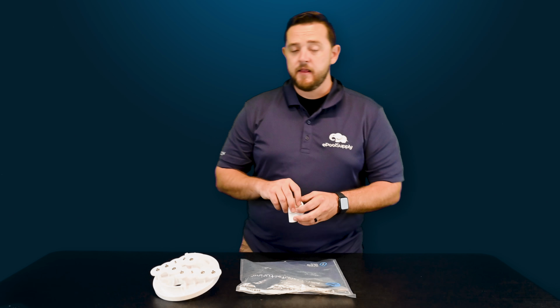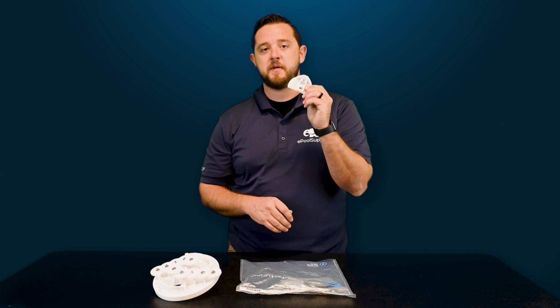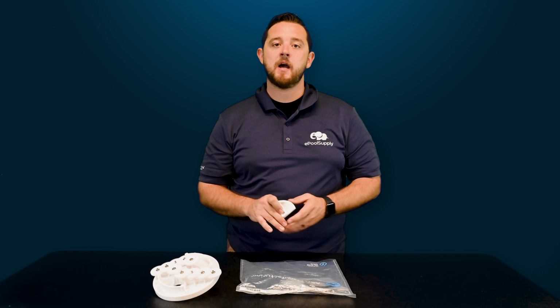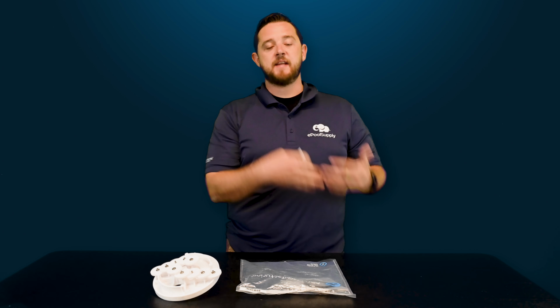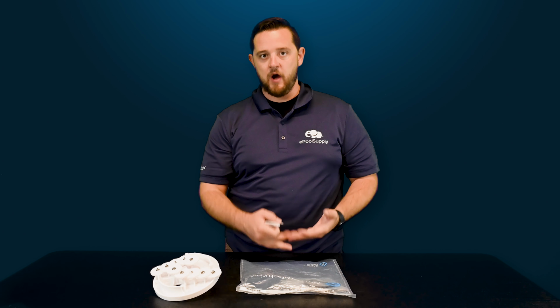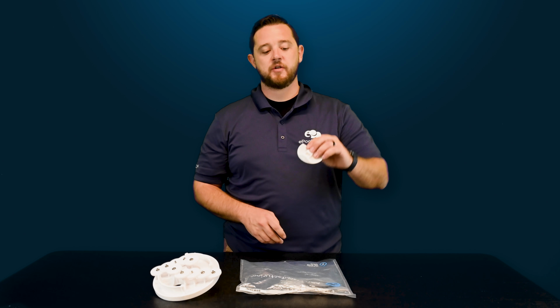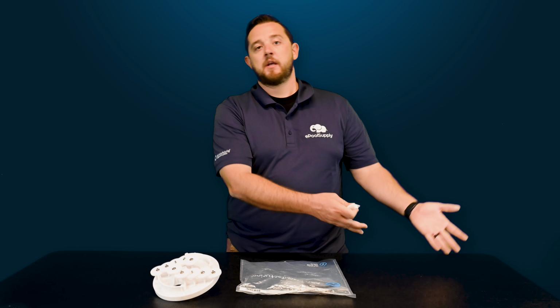And then again, the difference now between a 2" and a 1.5" is going to be the cam. So they have color coded all of the cams now, so that it'll help walk everybody through and identify just by looking into the valve which gear kit that you need. So then you guys aren't playing the guessing game and having to run through everything. They actually color code these now so that if you have a green one, you're going to be looking at such and such.